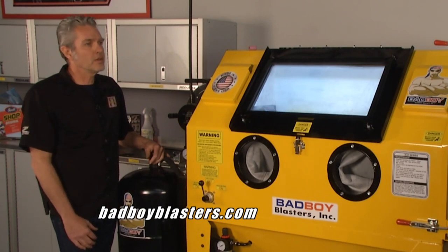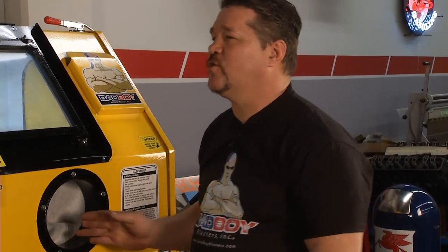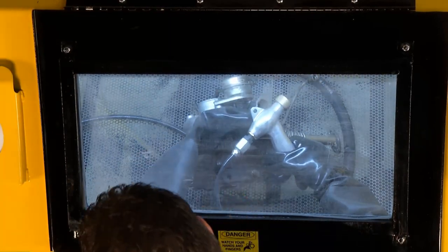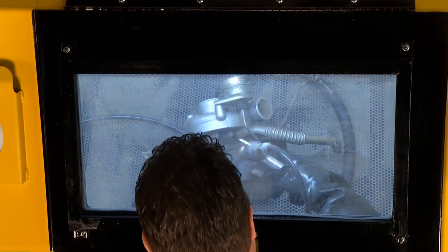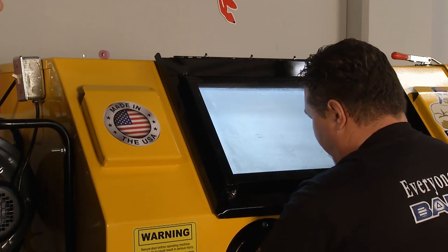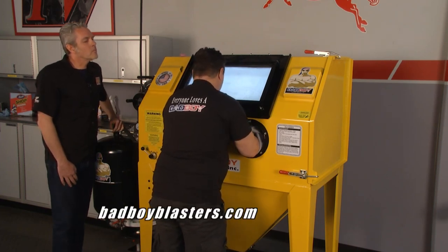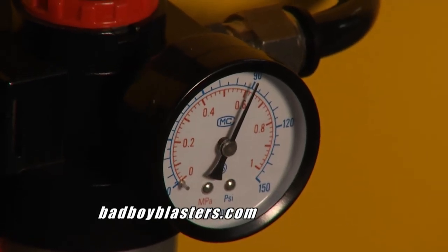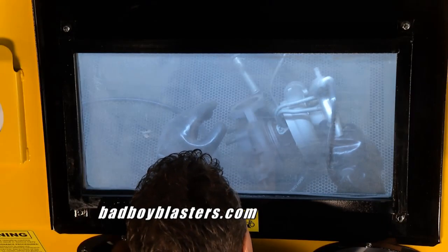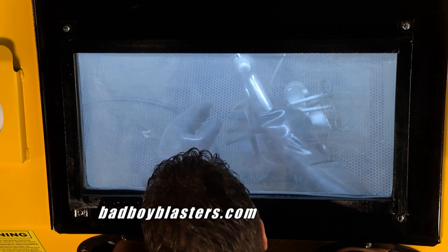The BB1050 also has different nozzles for different needs. A homeowner or weekend warrior runs the ceramic nozzle — a four-pack is about 10 dollars, but they only last about two hours. Their boron carbide nozzle is a 1,500-hour life nozzle — it's a little bigger in diameter, so it gives you more media pull. That's 1,500 hours versus 250 for a standard nozzle. The long-life nozzle would basically last a lifetime on the machine.